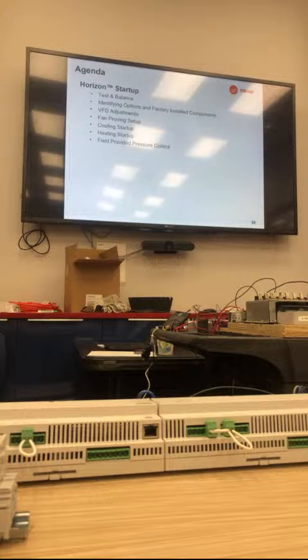We do know that's an issue. You can't test it, so I guess if you go to cooling and it works, then I guess it works. Yes, you should not really have to touch that controller. We're going to talk about it. There's a jumper on the back end that I need you to verify. Which controller? The water valve controller? The back controller? Yeah. Last time, I don't know if it was Jimmy or somebody, I changed like 6 points in that thing, because they weren't set up. Yeah, because it was causing the unit to trip out.